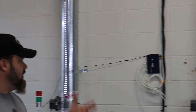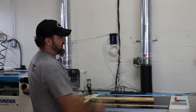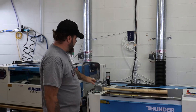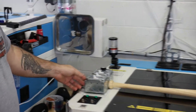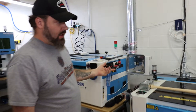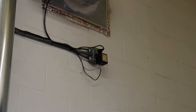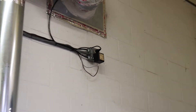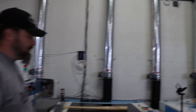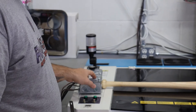For some people this might be overkill, but for me it made it easier because I don't have to reach over the machine or move the machine to get back there to open up a manual valve. It's really easy to wire — these are just wired to regular light switches with a 24-volt power supply, basically the same thing you'd use for your doorbell or any kind of system like that. If you look up there in the outlet, you see the black box — it's just a 24-volt AC converter. It sends the power down here to these different valves and allows us to control them individually.